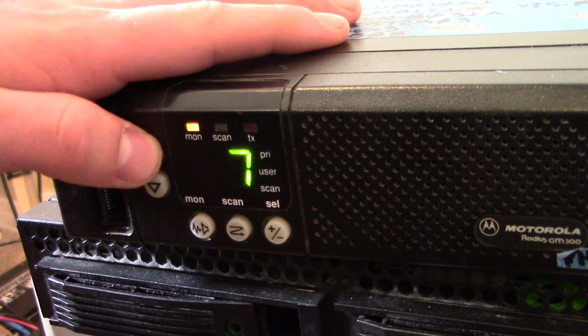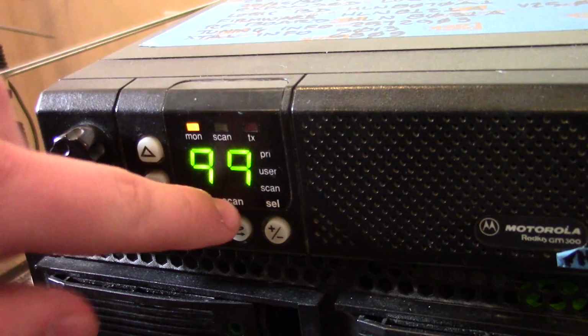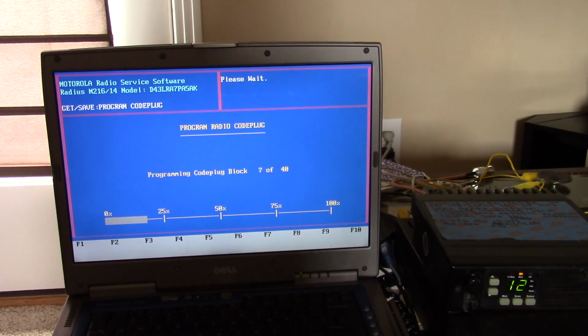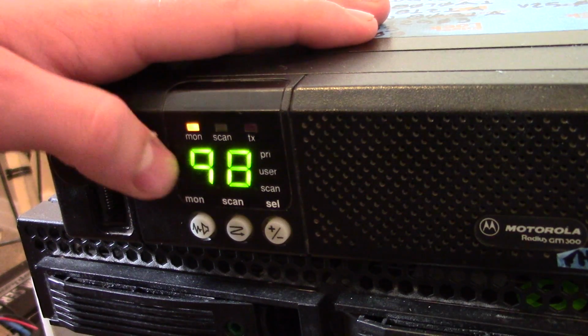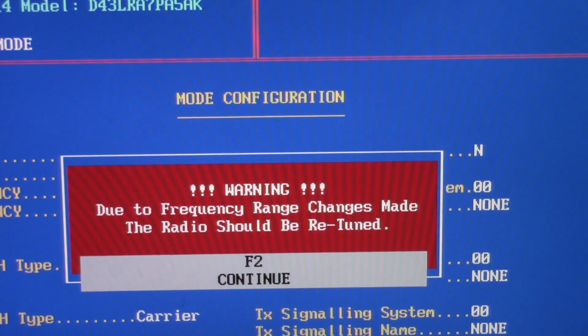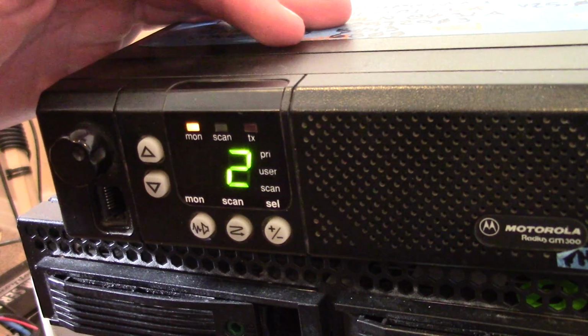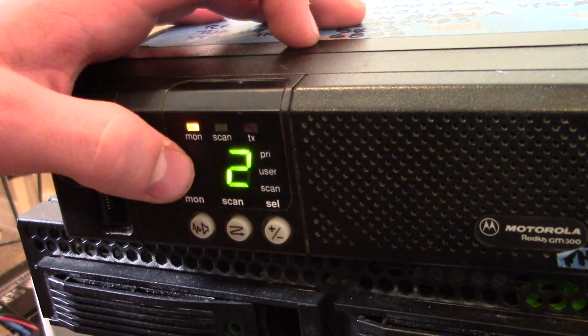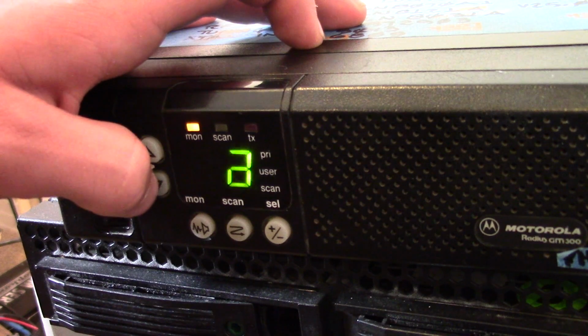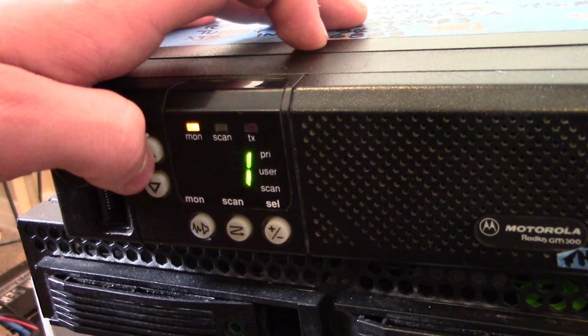Now you might ask what happens when I get to channel 12. Well, I've reprogrammed it to something other than 12, so it looks like, same with 22 and 32. So, my program basically scrolls through very quickly until it finds channel 2, and then it pulses the desired amount of times either up or down to get to the desired channel.